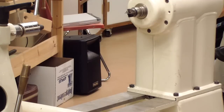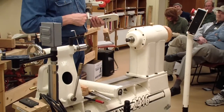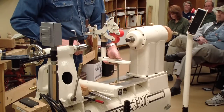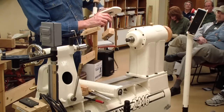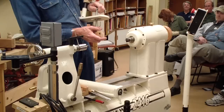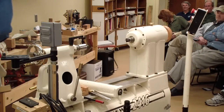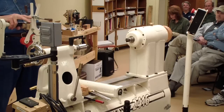The other thing, if you have a mechanism, if your anchor is such that you have to unscrew this thing to get in your lathe, make a wood one that will pass through the gap in your bed. This little stop on here, when you turn it, hits on the side of the bed, it stops. You continue screwing it in, it locks it down tight. When you unlock it, it opens up until you're done. Terry, why is that rod so long? You get a really deep bed. I have a Conover lathe with the bed about that deep.